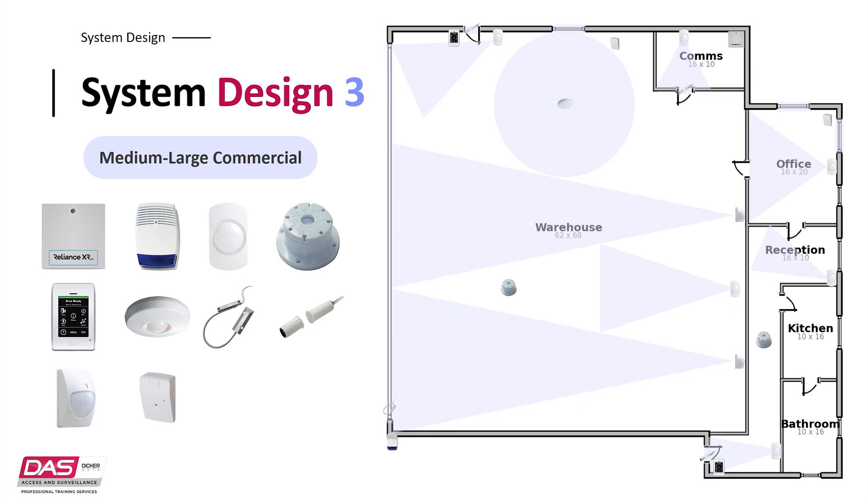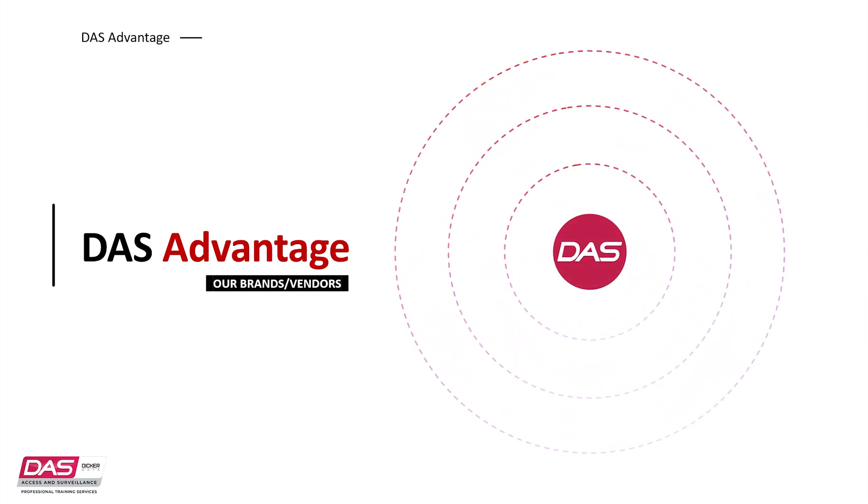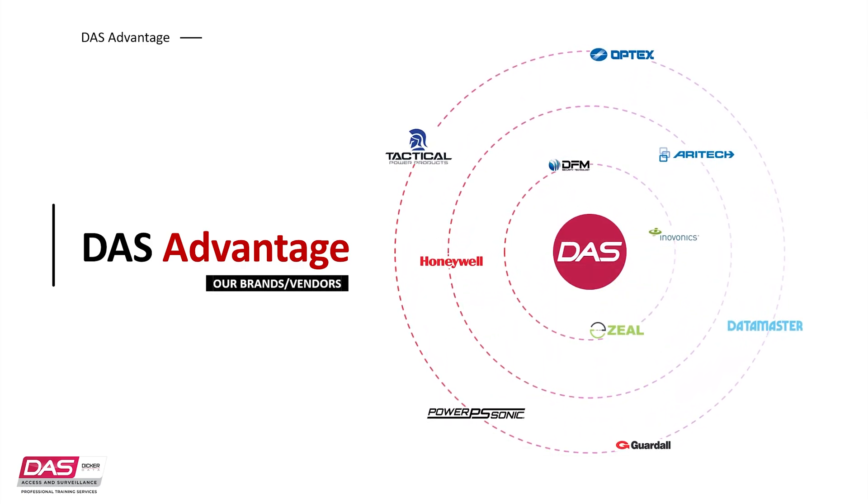I'm going to add a device to this site that isn't going to be used for alarm functions; however, it may help the business improve response times in regards to their deliveries. I'm going to do this by adding a PE beam to the garage door, which will detect any object such as delivery drivers crossing the beams. This will be configured to provide push notifications to team members via the UltraSync mobile app. An alternative that could be more cost-effective and provide similar results is a curtain PIR. And as it's a factory with neighbours not too close, one siren and strobe may not be loud enough, so I'm going to add in a horn to give it that extra impact. As you can see with these system designs, building a system that is right for your site is possible and we have all the products to support it — that's just another DAS advantage.